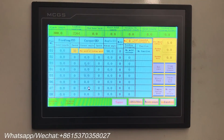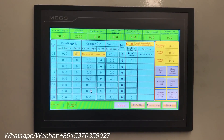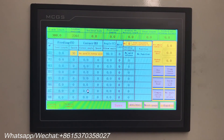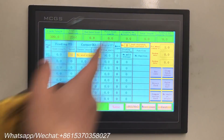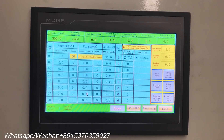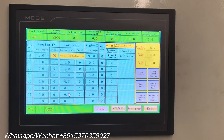The first bend length is the length of the first straight line distance. Grasping the material length is the length of the trolley's grip on the pipe. The total length is the actual length of our pipe, and the die well radius is the radius of our bending die.